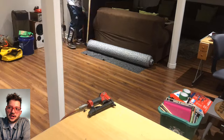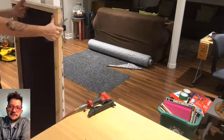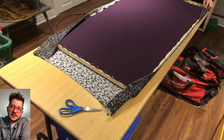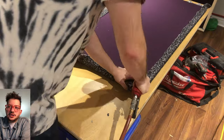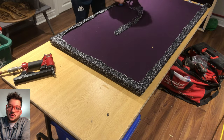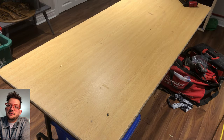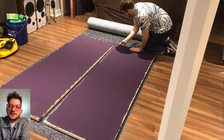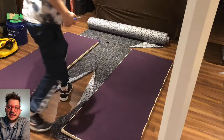Here we're cutting for our front fabric and I'm leaving a few extra inches on both sides so the fabric has enough space to wrap around. You can see we put our rock wool comfort board 80 acoustic insulation inside these frames. I like to get all four corners first, then do one long side, and then tension the opposite long side against that first long side before getting my short sides upholstered. I have other videos with closer detailed looks at how I do my corner detail and how we get the fabric to lay nice and flat.